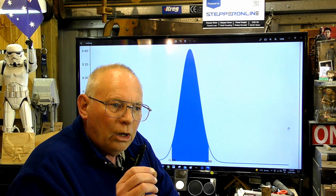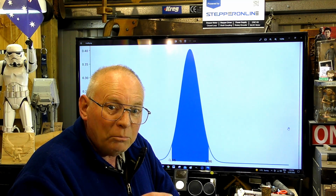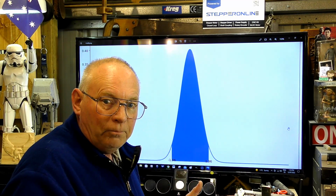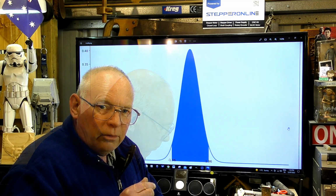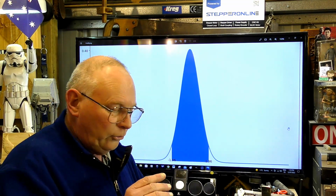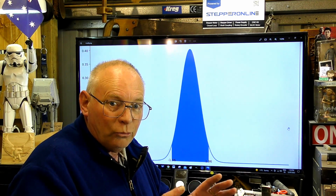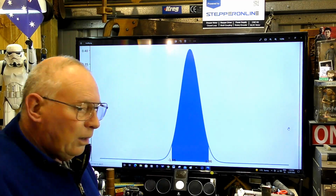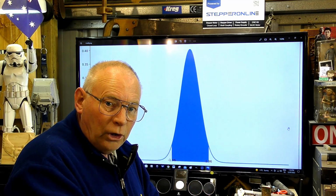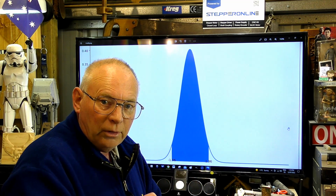approximately 0.19 of a millimeter. That's the outside diameter of your beam. Okay? So when you're using a laser beam, and this is very, very important, we're going into the science and the physics of a laser now, and how it does what it does. So you have an overall size of beam now after it's been focused onto your material of 0.19 of a millimeter, which is very small.